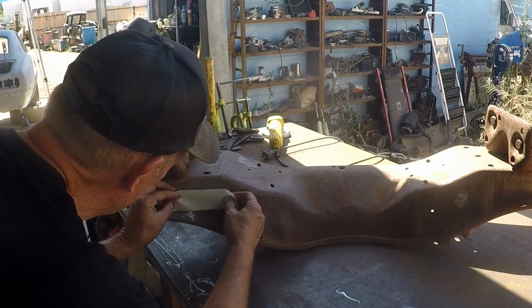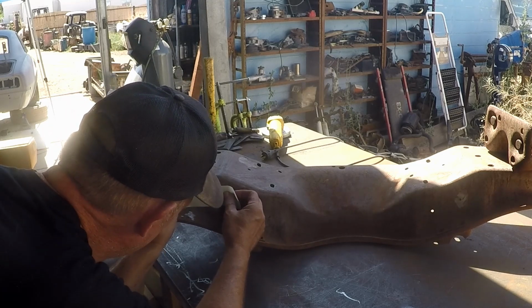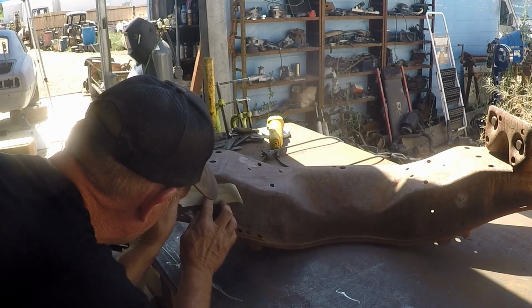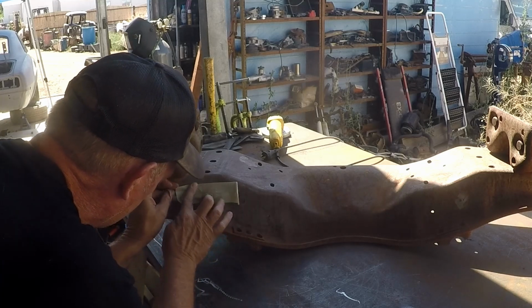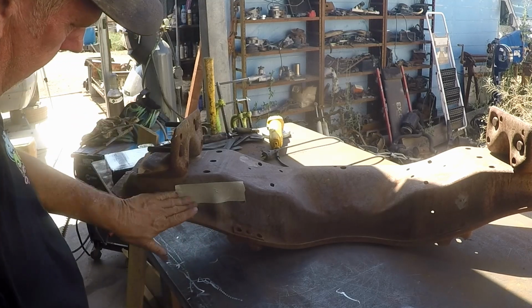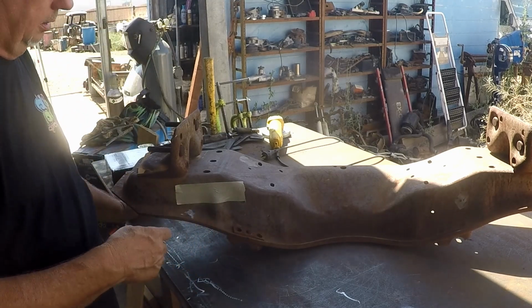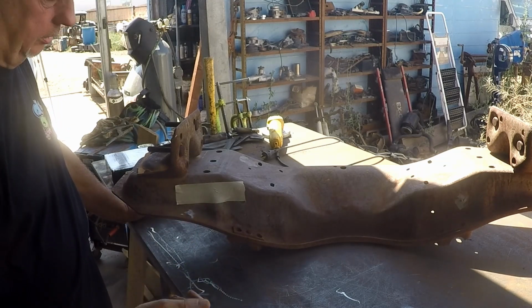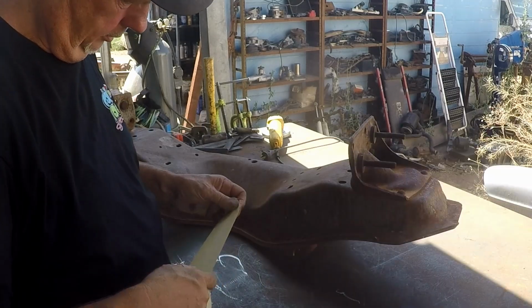And we're going to make ourselves a mark like this right here, pretty much wherever we want, as long as you can get your 2 inches out of it, or your 1.88, you're going to be all right. Now we're not going to go that far, but I wanted to make sure we had enough going over there. So we're going to scribe this line, and we're going to be able to cut to the outside of it. You can just leave the tape on there and cut to it. As it starts to get hot, sometimes it burns, sometimes it curls. So we're using this just to set it up. Put another piece over here.